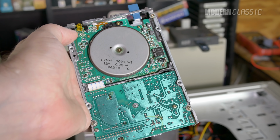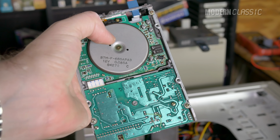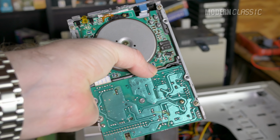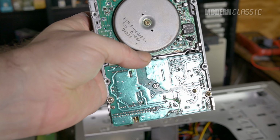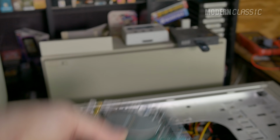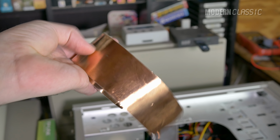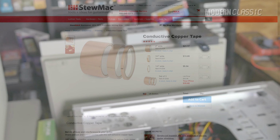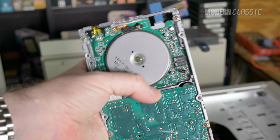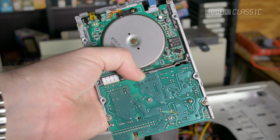But no, nothing worked. I think what the problem is at this point is the tracings, which are just really bad. And you see here, if you can see that, where my thumb is again, I have tried to fix that. We guitar players have our little secrets, and one of mine is this copper tape, which is conductive not only on the tape side or the top side, but actually has conductive adhesive as well. So you stick a little of that tape on, and it's like sticking a wire on something. So I've done that, but it didn't help.